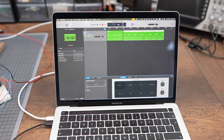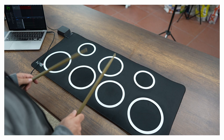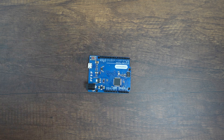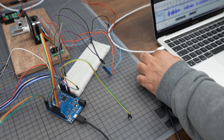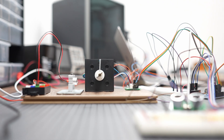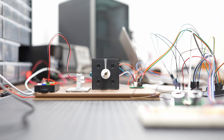That's where I hit the next snag. For the music, I'm using MIDI software like Apple's GarageBand — it's an awesome tool and I've had great results with it on previous MIDI projects. This is exactly why I chose the Leonardo board, since it can act like a plug-and-play human interface device without any extra software. The snag is related to synchronization: everything depends on keeping the motor steps and laser cycles perfectly aligned, but when I throw in another blocking task like sending a MIDI note or reading the ultrasonic sensor, the Arduino stalls unpredictably, messing up the timing.